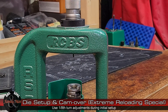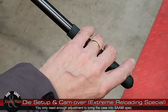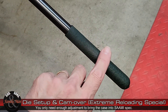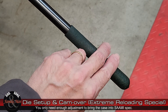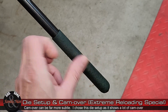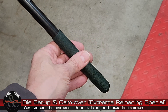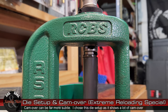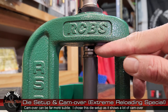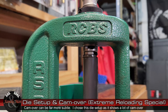What's going to happen now, when I lower the handle and raise the ram, is that at a certain point that handle will kind of stop — you'll feel a resistance at that point. But if I give it a little bit more pressure and push it down a little bit more, that is the cam over. I'll lift that up again, all the way down — that's the cam over. You'll also notice that we do make absolute contact between the shell holder and the die itself. The cam over is this process.